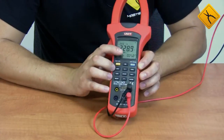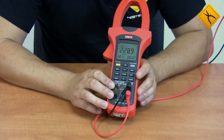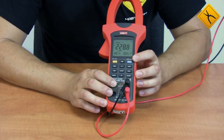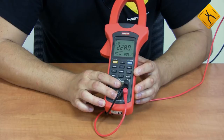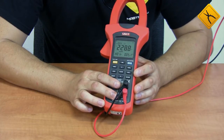The total harmonic distortion is 5%. I also tried to measure a square waveform, and the total harmonic distortion of a square waveform is about 41–42%. As this clamp meter is a 3-phase device, all the functional characteristics may be shown only during measurements in 3-phase systems, which we are going to demonstrate.